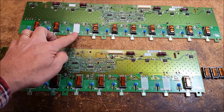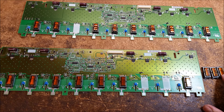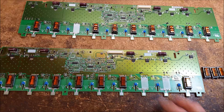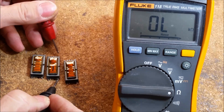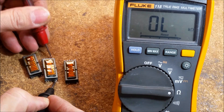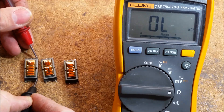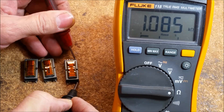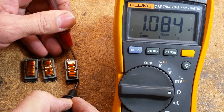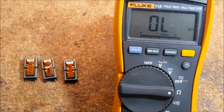I went ahead and pulled just one random transformer off of the replacement board I got. You can see it over here on the far edge of the screen. We've got the bad one in the middle, the original one, and the new one I pulled off the other board. I'll put the two good ones back on these two positions, but let's test them first, at least resistance-wise. Just for reference, here is the defective one — we see about 1.53K. This is the original one that came off the board: 1.084K. And then this is the new replacement: 1.085K. We're not looking at hardly any difference — both of these seem to be matched almost identically. So let's go ahead and put them on the board and see what happens.